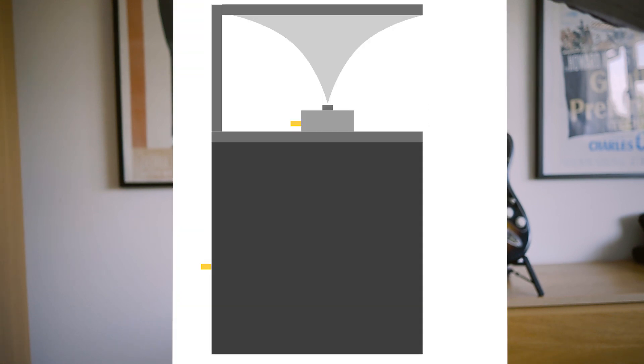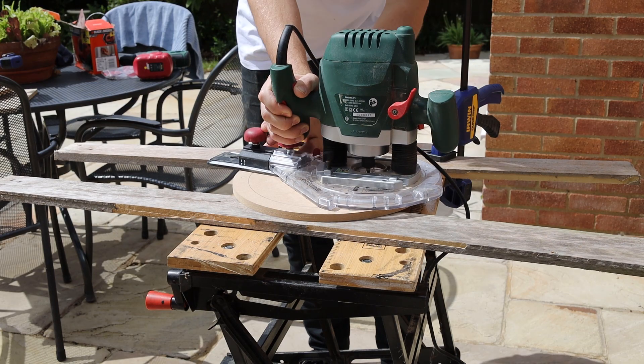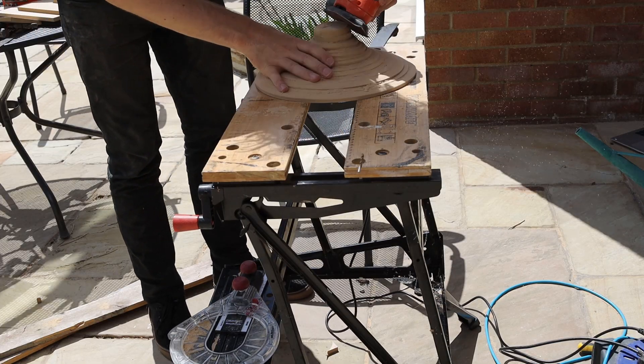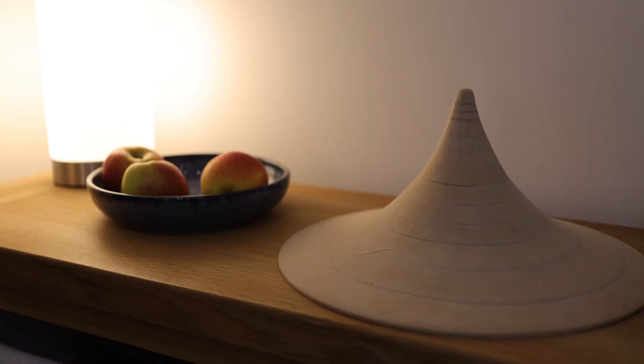I recreated my cone design in Photoshop using 12mm thick MDF — cutting out circles, sticking them together, then sanding into a perfect cone. After two days of power sanding, the cone was complete. For the driver, I found an ATC PA75234BLC on eBay — I love ATC loudspeakers and their drivers are key to why their speakers are so good. I placed the Thiele-Small parameters into WinISD, a loudspeaker cabinet simulator, which provided the optimum cabinet volume. I decided to go sealed, as the smoother output curve would be easier to manipulate using my digital crossover.